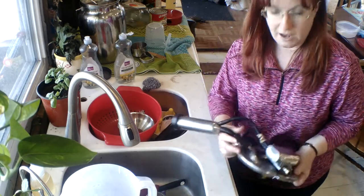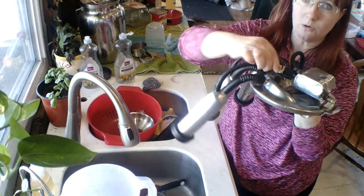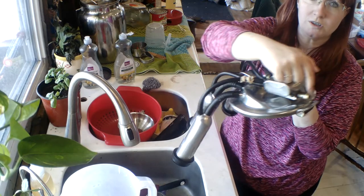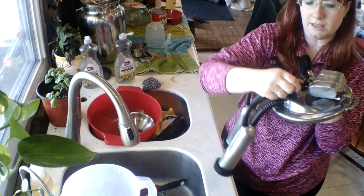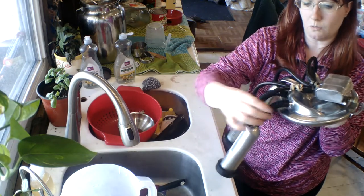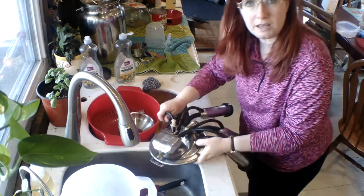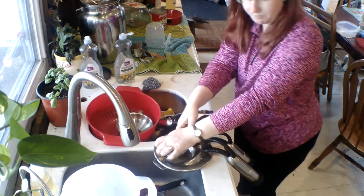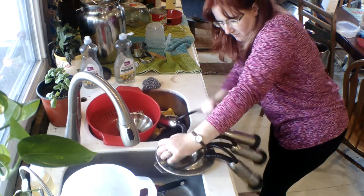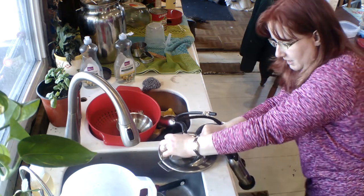So the vacuum hoses go to the pulsator, which is attached in the back here to the vacuum pump. So we want to take these off. Don't worry about these right now. They're a little harder, but I will show you how to take them off. We want to get the pulsator off first. There's no secret. You just have to pull it, muscle it off. And this being soft rubber, sometimes it can take all of my strength to get it off.